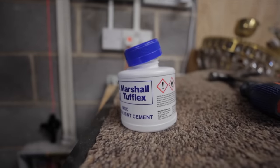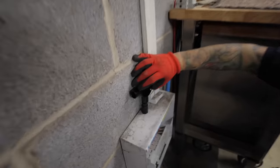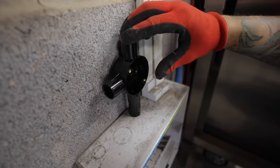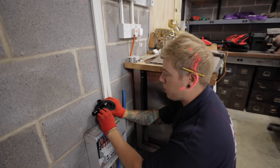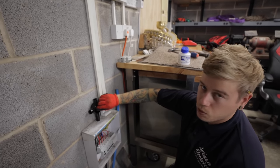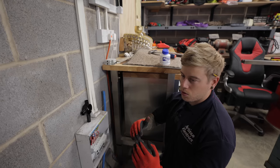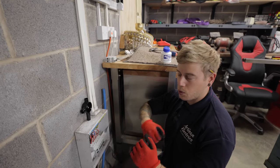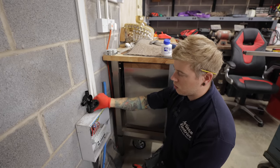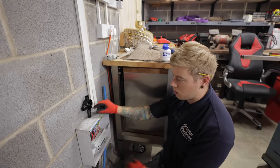With the solvent cement, don't put too much on - just a little bit around the inside. When you push that on you know you're going to get a nice connection; both bits of plastic are going to be bonded together. I've seen it so many times where people don't use it and over time either the conduit will warp or someone will knock it. Just takes a few seconds - just a little bit of solvent cement and it's going to keep it all nice and solid and held together.